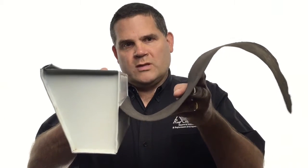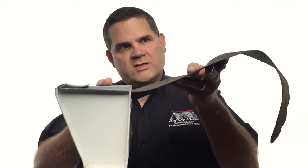Up here, we have a lot of water pooling everywhere. What we found is called anti-ponding metal. I don't have a sample of it, but what it does is when the tar paper is pooled like this, we actually straighten it out so water will rush from the top and down into the gutter. It's an easy fix, but it's expensive and time-consuming — it's labor. The materials are not that expensive, but it's the placement and having to redo something that should have been done when the tile roof was originally installed.